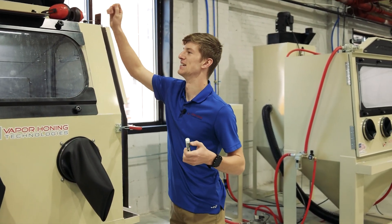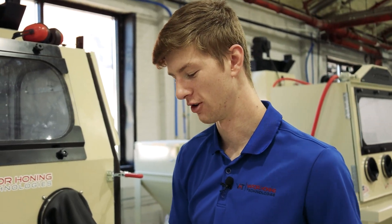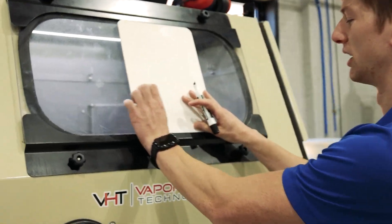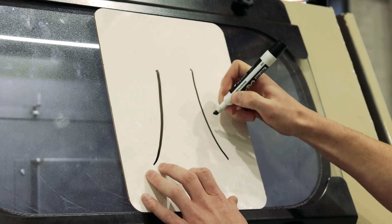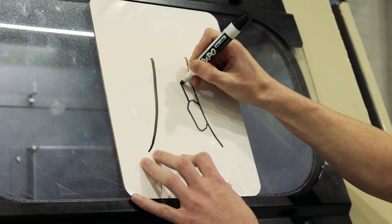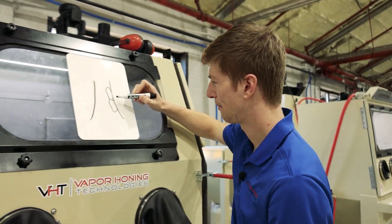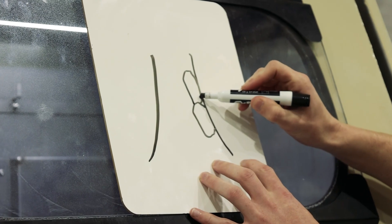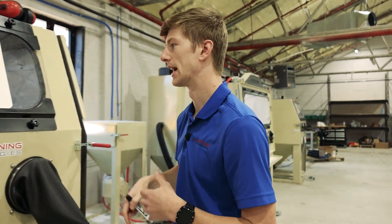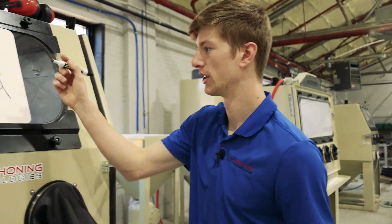You're causing stress on the surface but also relieving stress. The easiest way to explain that is to draw a little bit — and I apologize because I'm terrible at drawing. Let's say you're working with a connecting rod, which is what we'll be working with in just a minute. When you cast that connecting rod, there are places on the surface where you form pockets that stay together, but there are small portions that aren't fully filled.